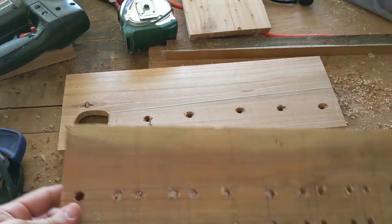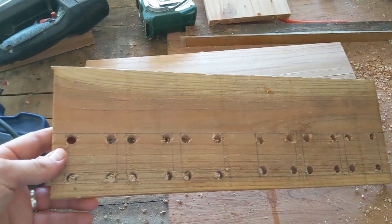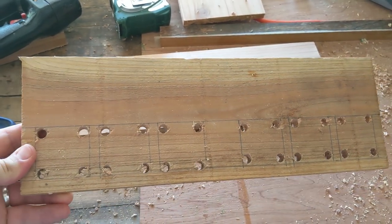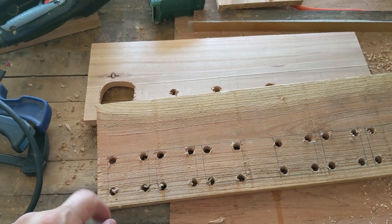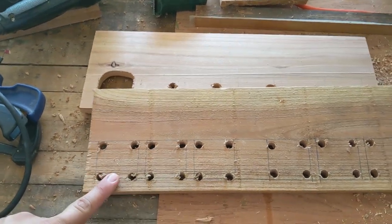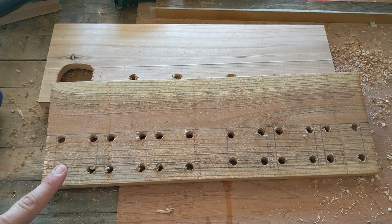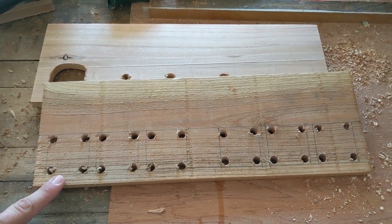So I just laid out a new board, and this time I put holes in all four corners of each laid out hole, and now I can just hopefully straight line connect each one. It should leave a decent radius in each corner. I purposely did not plane this board just yet, as I realize it's going to leave a pretty rough surface, and I'll plane them after they're cut and hopefully clean up some of that tear out.